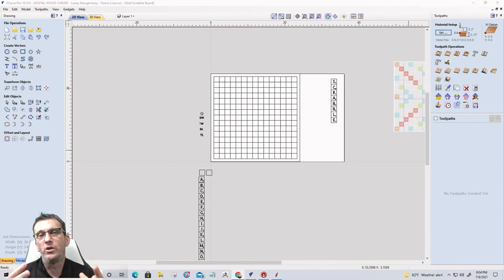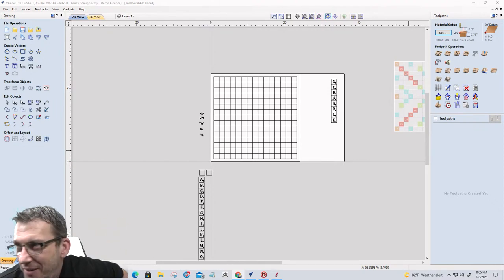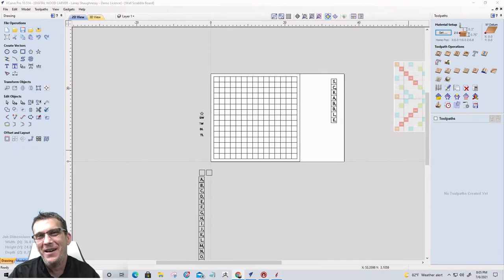So when you go into the store and you buy a 1x8, you are actually buying a 3/4 inch thick board that is 7 1/4 inches wide. When you buy a 3/4 inch sheet of plywood, you're buying a 23/32 inch sheet of plywood. Why? I don't know. You'll have to ask the lumber industry that one. That's not my forte, but I believe it is different overseas. I think when you buy a 10 millimeter sheet of plywood, it's 10 millimeters. Correct me if I'm wrong, anyone overseas that works with the metric system.